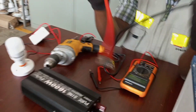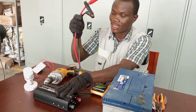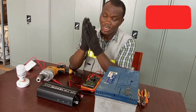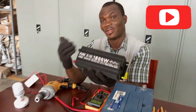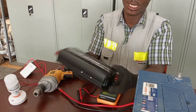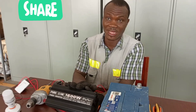We are connecting these two leads between the battery and the inverter, and we get our output to be 240 volts. Mind you, the inverters vary in capacity — depending on the number of appliances you want to supply power to and the watt rating, you have to carefully select your inverter. I would suggest you shouldn't connect anything more than 1000 watts to this inverter.